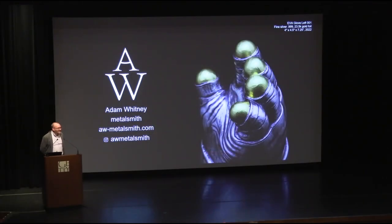Questions from Zoom: Was lost-wax casting ever used to make rhytons, or molds to hammer over? We see evidence of both in some examples. I can't reference the exact works, but there was some casting to just make rhytons, and also hammering over molds — two halves and then soldering them together. Usually those are heavier and the design style is different. Whenever something is hammered over or cast, you usually don't see as much extension of the head or legs — it's more compact. And if you look at the weights on the description, you'll tell it's a heavier object.